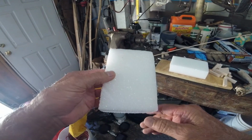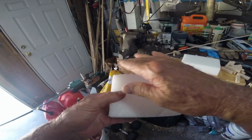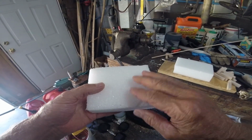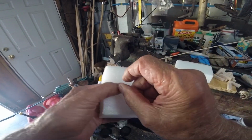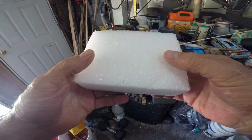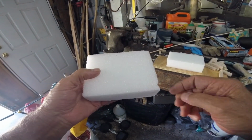And then I'm going to mirror glaze wax it as a mold release. Then I'm going to Bondo my first coat, then put fiberglass chop on it. And then once that sets up, I'm going to make a thick mold. It's going to be bulletproof. Then I'm going to flip it over and peel off all those playing cards.